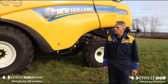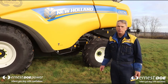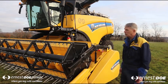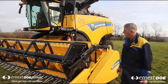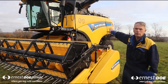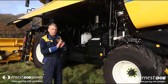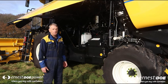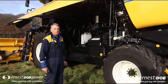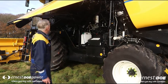Once the crops are fit and ready we use this machine here called a combine harvester. It's a New Holland product with 500 plus horsepower. The idea of this machine is to cut the final crop. We attach on the front of the combine this header, which is 28 foot wide. Headers also go up to anything up to 45 foot. The idea of the header is to drive into the crop and cut it. The crop is then taken up what we call an elevator into the machine, where it is confronted by a series of drums which thrash the crop. The crop is then separated using a sieving system, and the good grain goes up into the grain tank at the top, which can hold anything up to 11 tonnes. Once the grain tank is full, the operator needs a tractor and trailer to unload into — this is where the long spout comes into play.